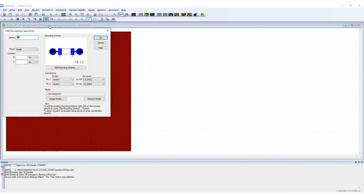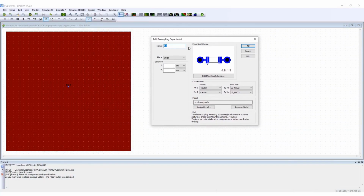Rory here again. There are two key elements of power integrity analysis. The first is a decoupling strategy, which we'll do as early as possible to guide schematic capture. And then the second is DC drop, which we'll do later after part placement. It's important to get a decoupling strategy worked out early in the design process. We'll do this decoupling strategy in two steps.